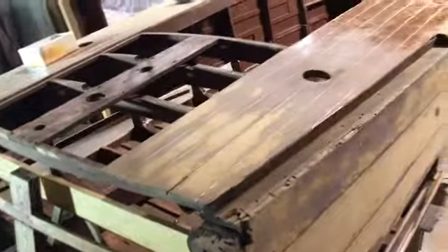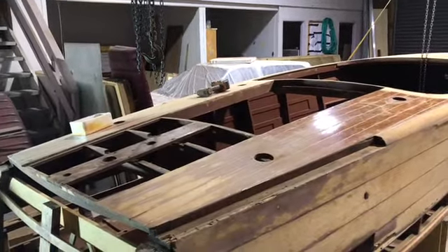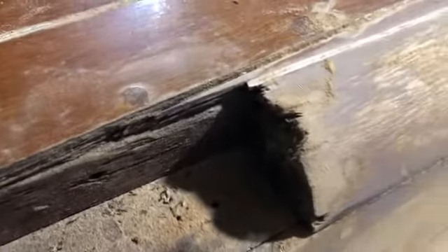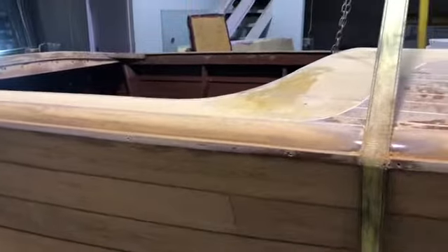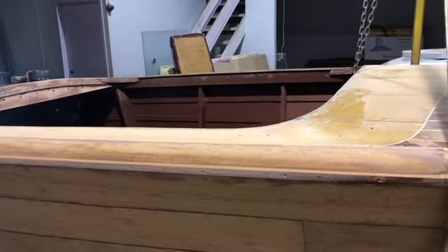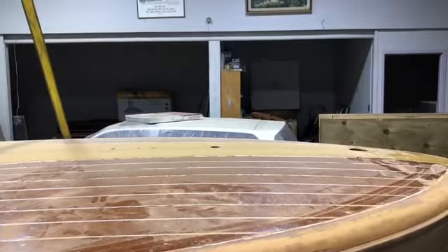Tonight has just been a bit of exploratory work — my first good look at the boat since it's been upside down — to get my bearings on what needs to be done. It'll have new running boards or corner boards through here, and this one is quite badly rotted. They're only butt-jointed so we'll cut the stock back to here and bring another piece down rather than taking this piece off, which would require going all the way back up — just a huge amount of work for nothing. So that's the update — boat flipped 6th of April 2020, just starting on the topside preservation of this 1950 Chris-Craft Riviera 20 in Hamilton, New Zealand.